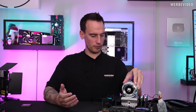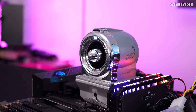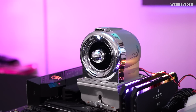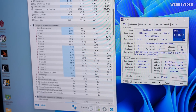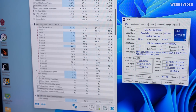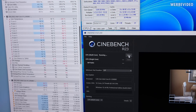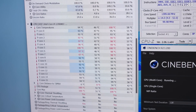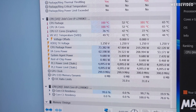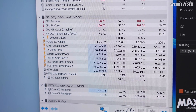The question that maybe remains is: how good does this jet cooler actually cool a 12900K? I'm still sure this thing is inspired by planes — this looks like one of those signal lamps you find on the wings of a plane, but certainly not on the turbine itself. At least idle is working, but the 12900KS is also downclocking to save energy and not consuming a lot of power. But what about Cinebench? That looks quite toasty — temperatures are just all the way up to 100 degrees Celsius, and the package power it can cool is just 70 watts. So that's not going to work — not even for gaming load.